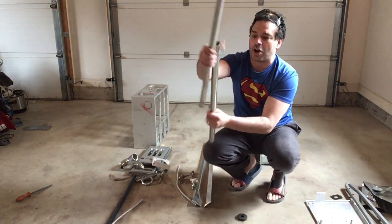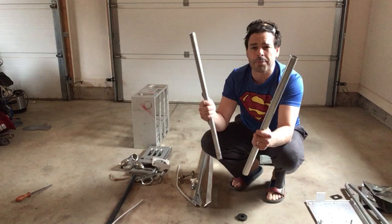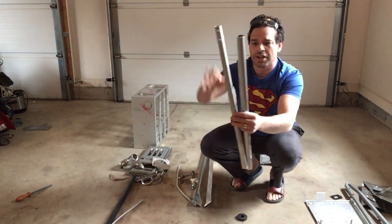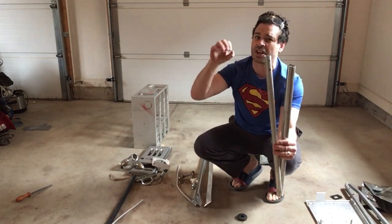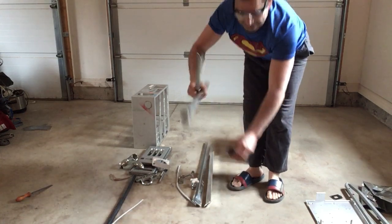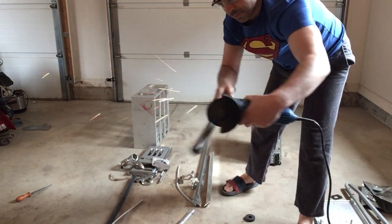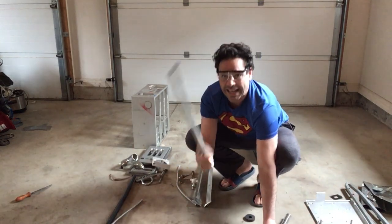I also wanted to mention: these come out of vacuum cleaners - all those power head cords. I see a lot of people pass these up. Here are two examples that look very similar. This one does look a little bit more dull, and sometimes that is a good indication of the difference between aluminum and stainless steel - stainless steel will usually be more shiny. But that is not a conclusive test. If I hit these with a grinder, they are both non-magnetic. One sparked - stainless steel - and one didn't - aluminum.